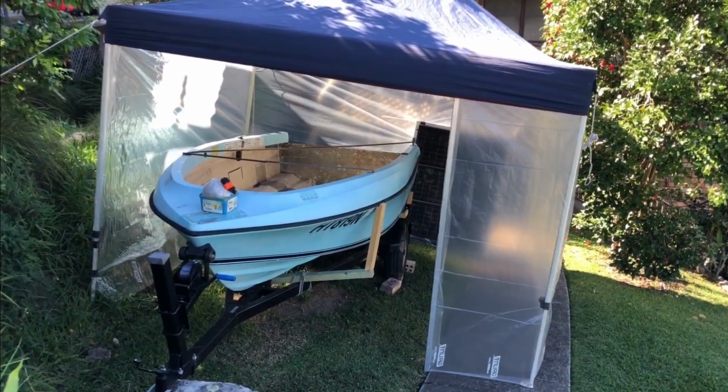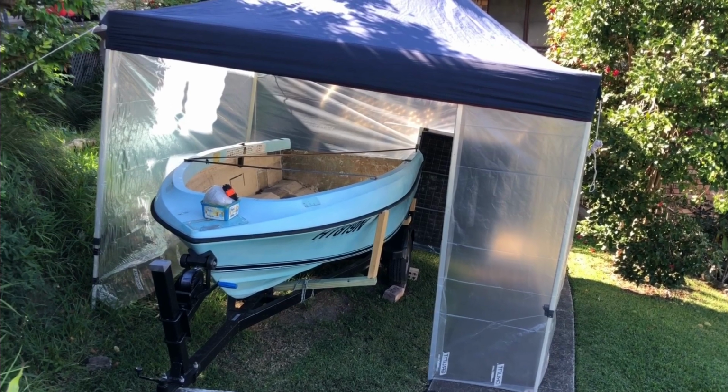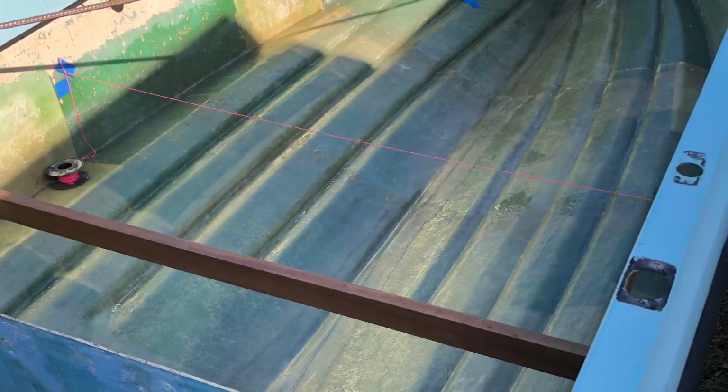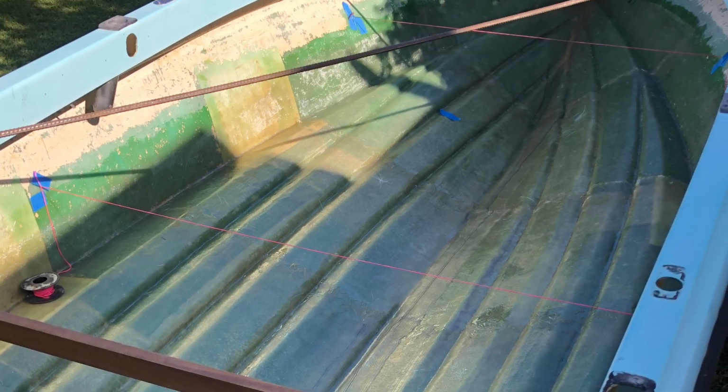So the next video will be the grind out, getting rid of all of the flow coat and also thickening up the hull with extra layers of chopped strand mat and double bias and vinyl ester resin.